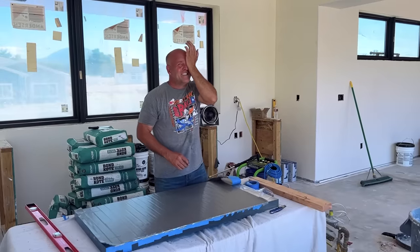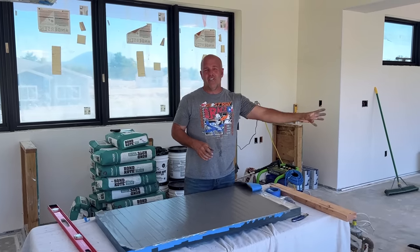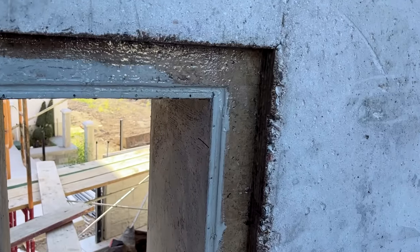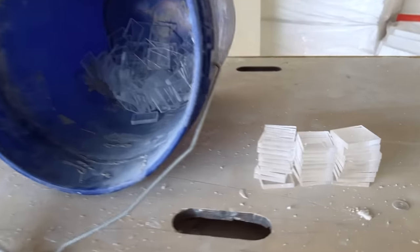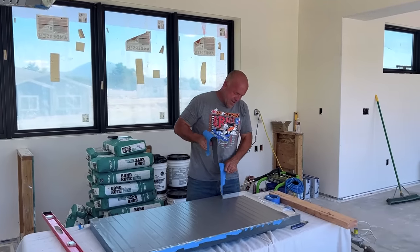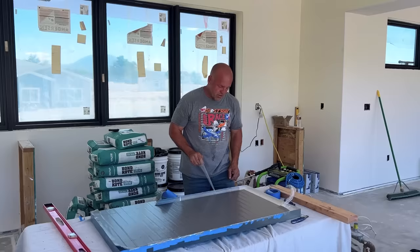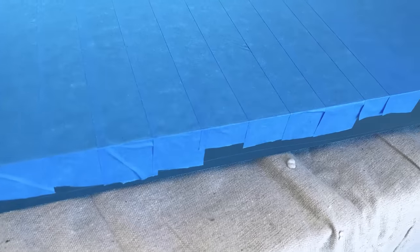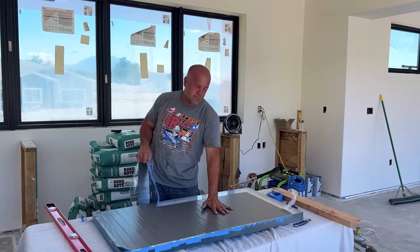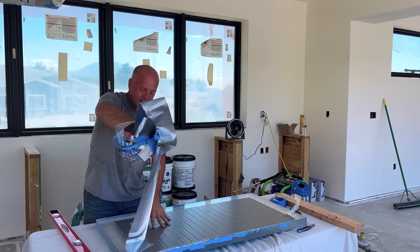This project just keeps going on. I thought I could get most of it done on Saturday and Sunday — I thought I could do it all in one day, which was ridiculous. Prepping those windows took almost three hours per window — a base layer a couple days earlier, then another hour and a half on the black layer and the standoff acrylic sheets to get the window to stand off the concrete. That's like 36 hours of prep just on the concrete side to get ready for 12 windows. Now I had to tape off all these windows. I used blue tape first because it comes off easier, then put duct tape over it, so during the rest of the pool process I don't nick or scratch these windows.